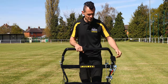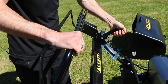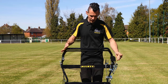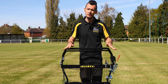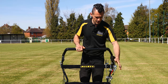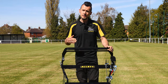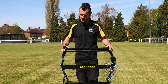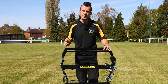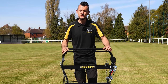We have a two-stage control system for the operation of the cylinder. We bring in the front bale bar — that's the operator safety presence — and then bring the over-centre lever in to engage the cartridge system. If you let go of the operator presence while the lever is engaged, that will kill the engine for safety, so you can't go to the front of the mower while the cylinder is operating. Disengage the lever first and then you can let go of the operator presence. The rear bale bar brings in your forward drive, and it's what we call a feather drive system — as you bring it in slowly the drive begins to take up, giving you gradual control over the machine, which also helps when turning.